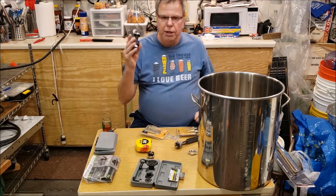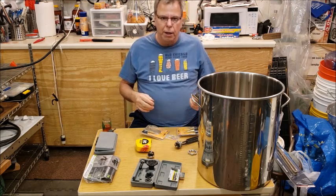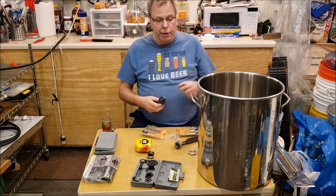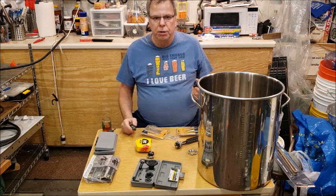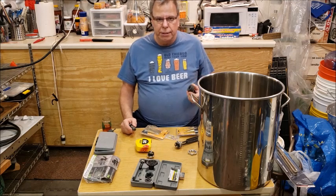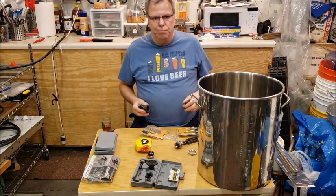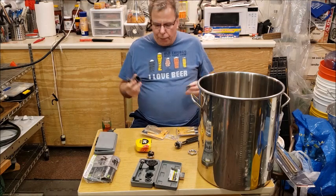But this particular hole punch is slightly larger than I want it to be. Now, these punches are made for conduit, and as such they're made for 1¼ inch conduit. This particular one is, but the hole that it drills is actually closer to 1 3/8 inches than 1¼ inch. So that extra 1/8 of an inch, or an extra 1/16 of an inch on each side, is a little bit too much play, and I don't know that I want to do that.